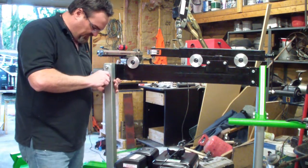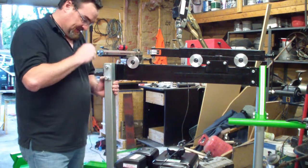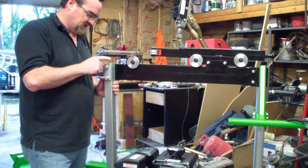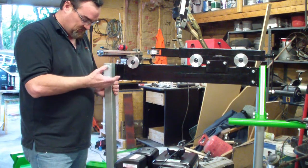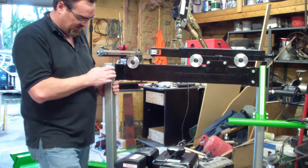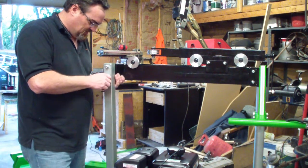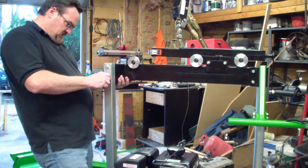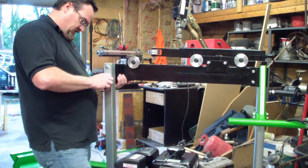That bolt is not going to line it up. But some of this has got — I'd say it's an eighth inch plate, this is probably 16 gauge square tubing. Then they reinforce it with — you could just use a washer, but this is like twice the thickness of a washer. It does a lot better job distributing the clamping force.